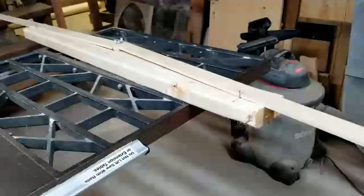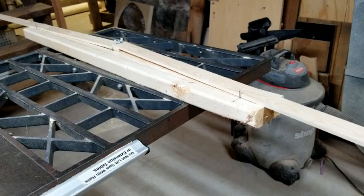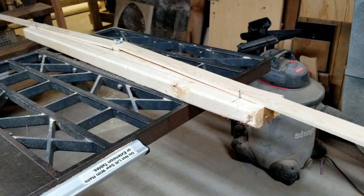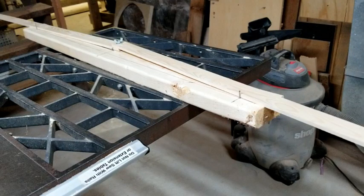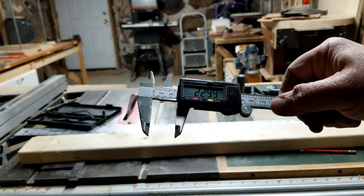I'm going to outline the process I used to make this dish. I made a 30-foot radius dish and there's a little bit of math involved. You can make any radius you want, but you need to know how big your sanding dish is and what radius you want. There's a formula that tells you how deep to make that curve. For example, if my dish was a 24-inch dish, I'm essentially looking at 24 inches out of a 30-foot circle. I've posted links in the intro to a couple of different radius dish depth calculators so you can figure that out.